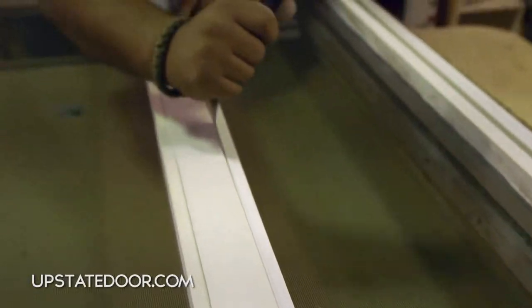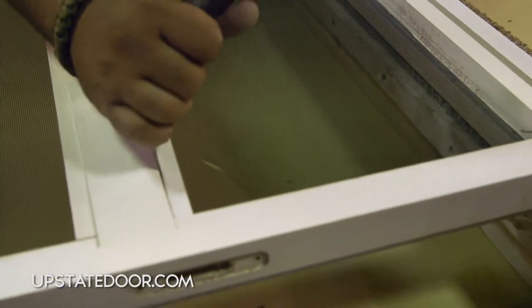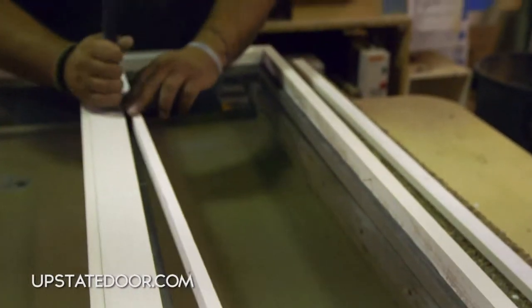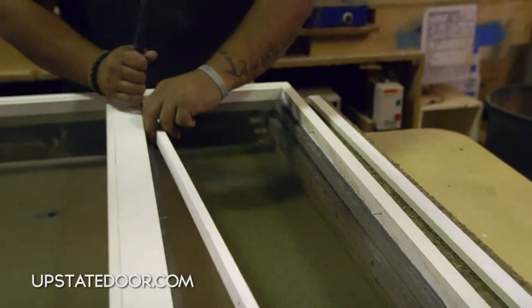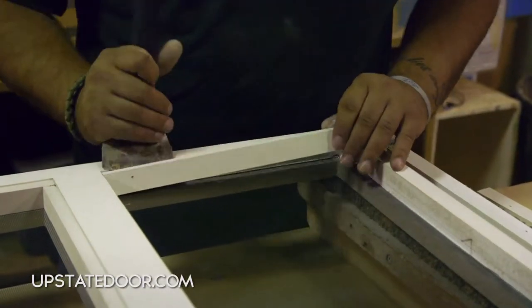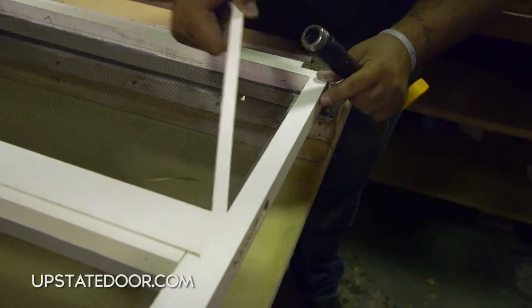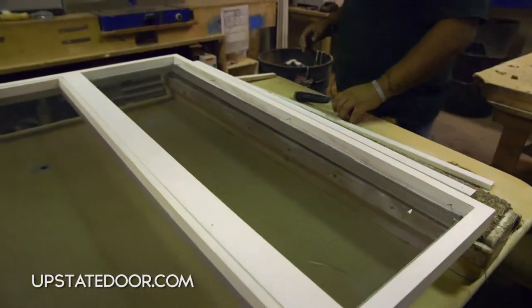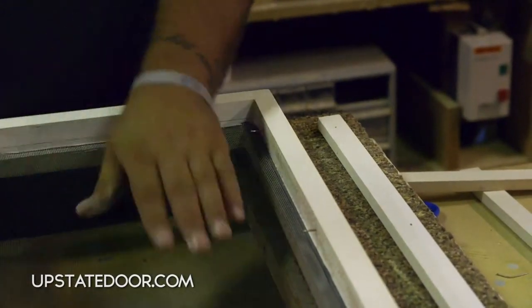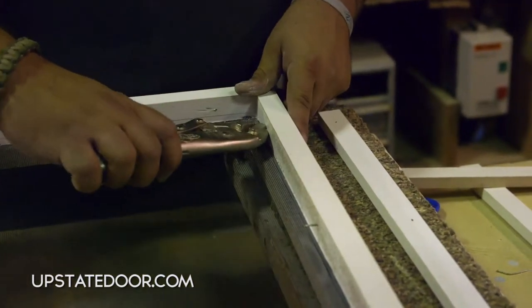As you're doing this, if you see where there's a nail, go right next to the nail to pull it out. Before you remove the spline, remove all the nails that are still in place. We would recommend taking vice grips and removing the nails. Anytime anything on the exterior has nails involved, we recommend using solid stainless steel nails or brads.